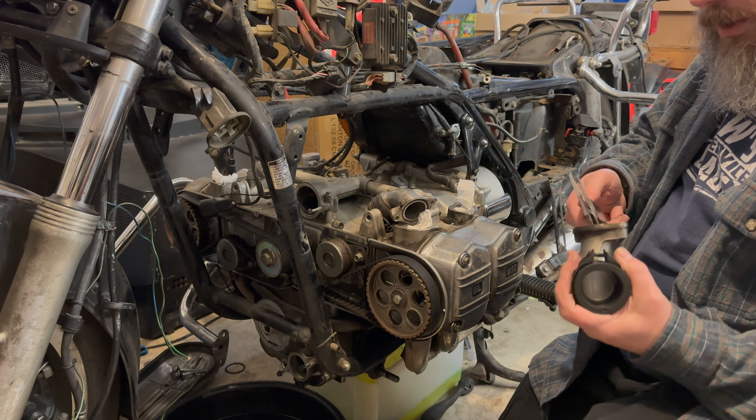These tubes each go in two centimeters on each end, so they stick in two centimeters. I can double-check that with the depth gauge that comes out of the back of the calipers. 18.92 - yeah, about two centimeters. There'll be some sticking out but that's fine.